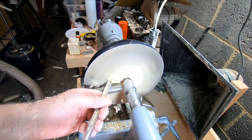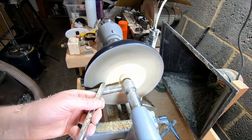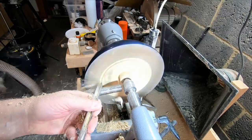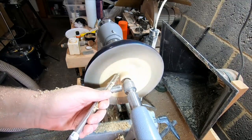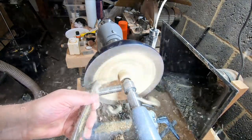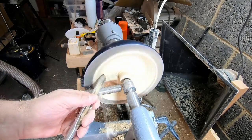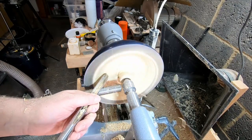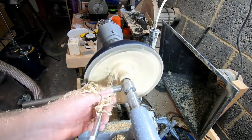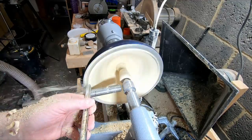To begin with, I started hollowing out the inside with a 3/8 inch bowl gouge. The wood was very dry and it wasn't cutting very easily. I persevered for a while, eventually switching over to a freshly sharpened half inch bowl gouge, which didn't seem to do any better, so I went back to the smaller gouge. Whilst doing the inside, I resharpened the gouge about three times to keep a good edge on it. With a sharp gouge I was able to quickly remove material, and the tear out on the inside was not nearly as bad as on the outside. The lathe was spinning at around 900 to 1000 RPM.